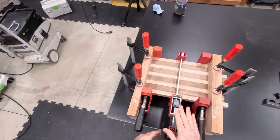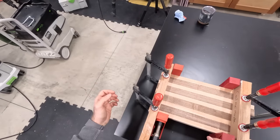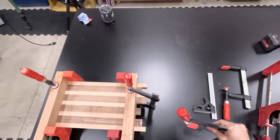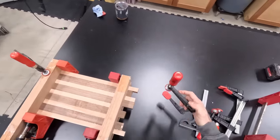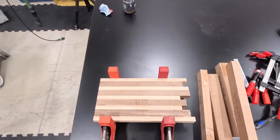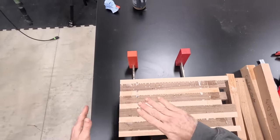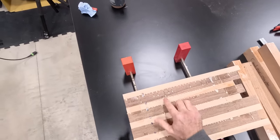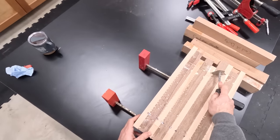I usually leave these in the clamps for about a half hour — that's the point we're at right now — and you can take the clamps off, especially if it's nice and warm and dry. Let's get the cauls off. You can also leave this in the clamps overnight with no problem, but if you need the clamps for another glue-up or want to get at all this squeeze-out, now's a good time. You might have been tempted to remove the glue earlier, but if you remove it with a wet rag it just spreads all over the place. If you wait about a half hour you get this skinned-over thing and the glue is not going to spread much further — you can get a nice little scraper and remove all of this stuff pretty cleanly.